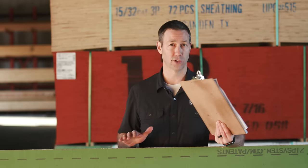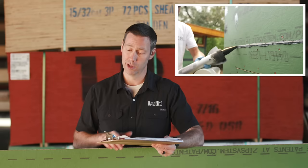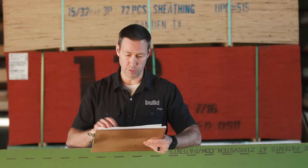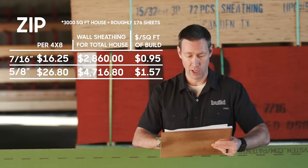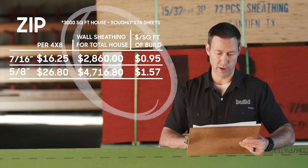Your house is weather-tight and incredibly air-tight, as we saw last week at Doug Cameron's job. If you do his Zip 2.0 method, this makes an incredibly weather- and air-tight shell. For a 3,000-square-foot house in seven-sixteenths OSB Zip, you're talking about $2,800. If you use the five-eighths, that's about $4,700 — equating to about $0.95 or $1.57 per square foot respectively.